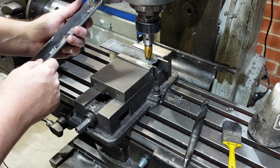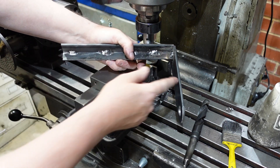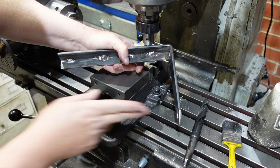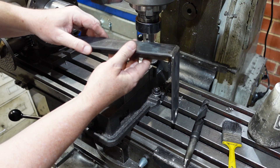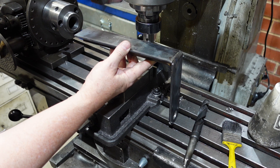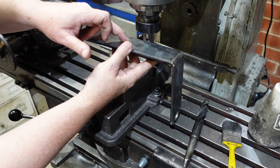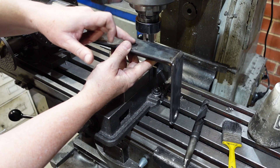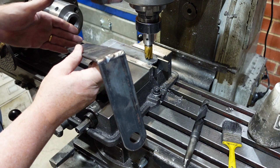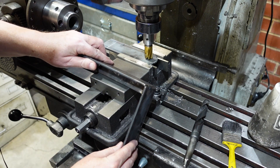I've welded one of these pieces on — sorry about the welds, my stick welding is a bit out of practice — but you can see the general form. One will go over here so I'll have a pair of holes and the pin will go through. It's then a matter of working out where the lifting point is. I could just put a loop in the middle, but the dividing head is irregularly shaped so the center of gravity is likely off to one end. I'll show how to work that out after I finish the welding, before the day gets too hot.